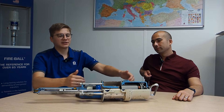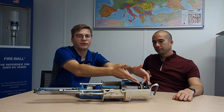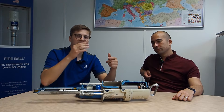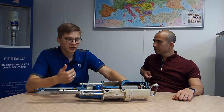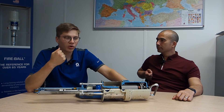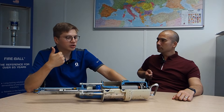For example, if this were a 10-to-1 pump, the effective area of the air motor here and the lower part here - that lower part would be 10 times less than the effective air motor area. It's designed that way because we need to create pressure in the line. All of these pumps are for different fluids and different applications.